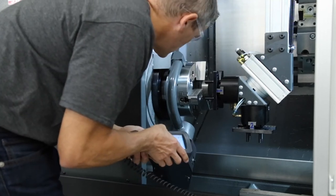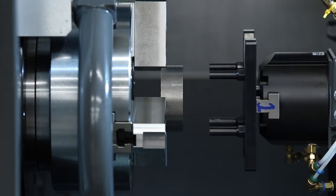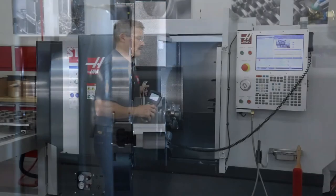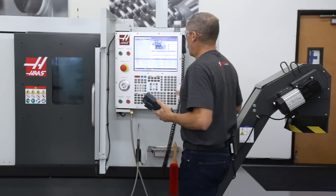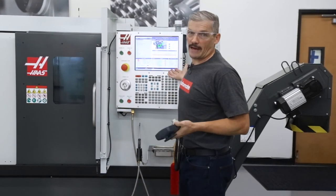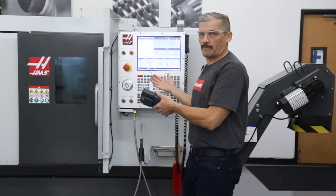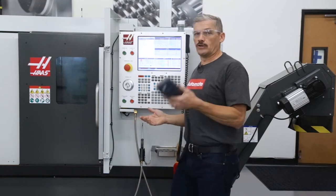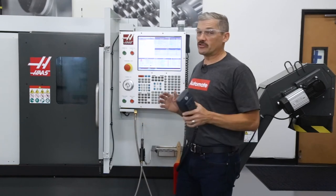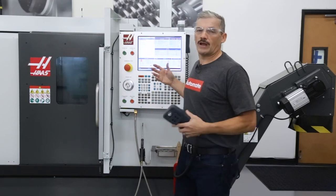Keep in mind that the part does not need to sit all the way up against the jaw step or collet stop. The part program will need to include a spring-loaded tool to reseat the part before starting the machining process — I usually set my part about one-eighth of an inch off the back face of the jaws. When we are done with the chuck load location, set the reference position by pressing record or F2. Close the chuck on the part with the foot pedal. Now let's open gripper number one, leaving the raw stock in the chuck, and jog away in AU and then all the way up in AW. Let's close the door so we can start the part machining process. Our part program is already made and the program is active, but we don't have APL mode activated right now, so the APL won't try to load or unload our part — which is good since we haven't finished programming yet. Now let's run our part and make some chips.